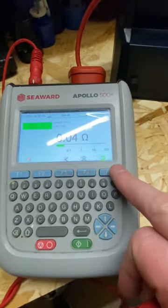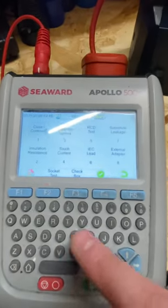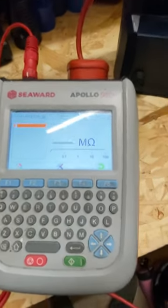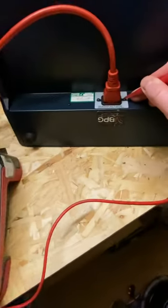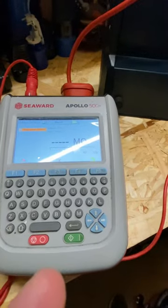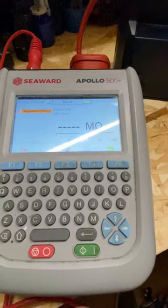Because we're doing it manually on the PAT test machine, when running through a predefined sequence of tests it would also need to carry out the insulation resistance test. I'm doing it manually here, so we'll keep the test probe still connected — it's not essential on a Class 1 test, but seeing as it's still attached, there's no harm in leaving it attached.